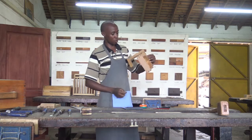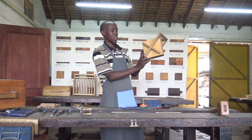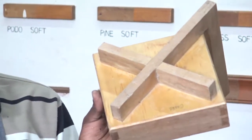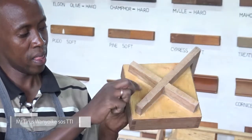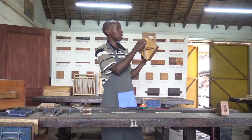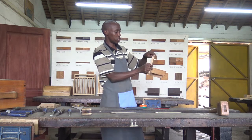On the base of this box, we have a piece of plywood. Then we have another joint at the bottom. Looking closely at that joint, it is a cross halving joint. The cross halving joint will have this piece cut into half and the other part also cut half. You remove this side from this piece and this side from the other piece, then you put them together and glue them to give you that cross halving joint. Here and up here, we also have bridle joints.